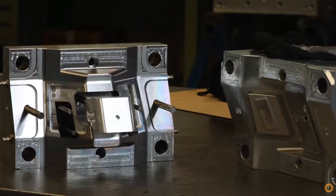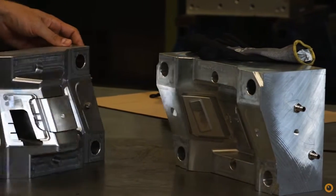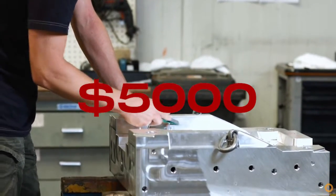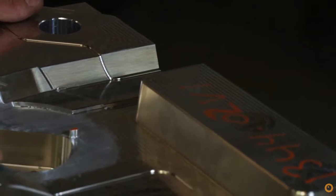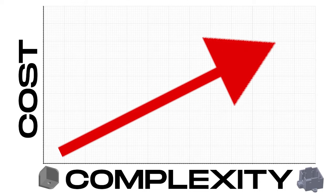In order to create an injection-molded part, you first have to get the mold. At minimum, that mold is going to cost about $5,000 — and that's for a hardened steel mold used for large quantities of parts, not some cheap aluminum mold that gets knocked out and weakened. The bigger your part becomes, the more expensive that mold becomes. After you get that mold, you are required to purchase a minimum of 1,000 to 10,000 parts in order to use it.